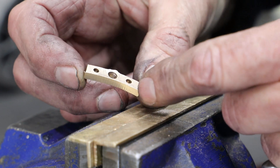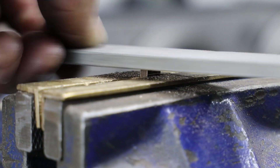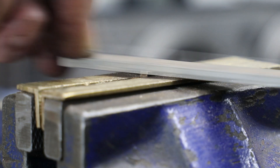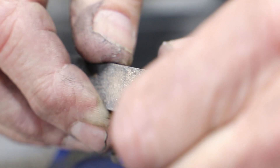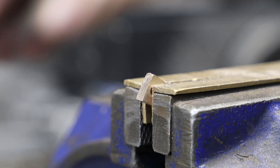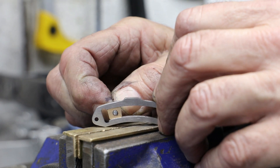With the two radii cut, I remove the block from the jig and get to work with the hacksaw and files to bring both blocks into shape and dimension. In fact I make them both slightly oversized in the angular sense — this will give me some leeway in the future and allow me to bring them back in if necessary.